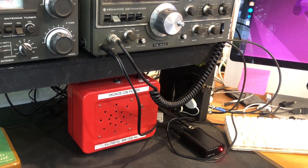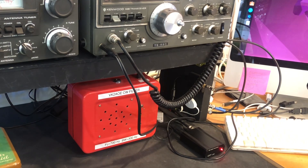The magic antenna box actually has an SDR through on it where I've got a switch that should switch on and off when I transmit. It works most of the time — not a hundred percent reliable. So far, QRP on the bands I use has been okay and it hasn't blown up my SDR, which is the main thing. But this commercially available unit may perform better, and it'll certainly allow me to implement the SDR as a waterfall, on all the time.